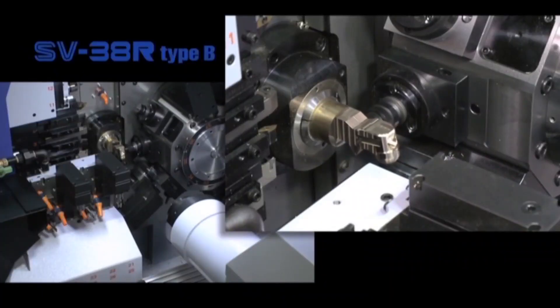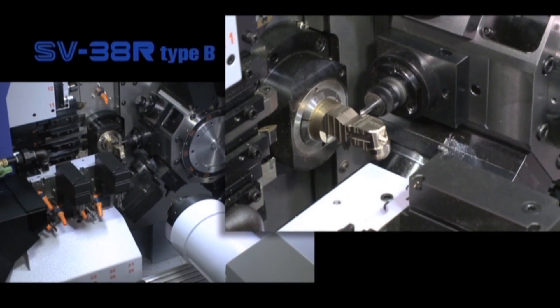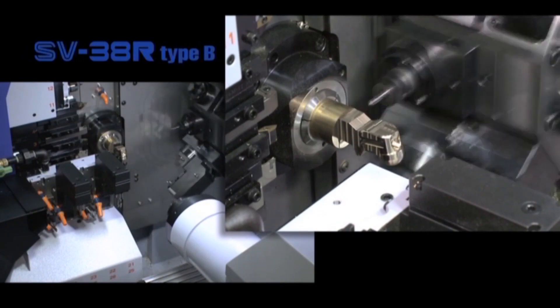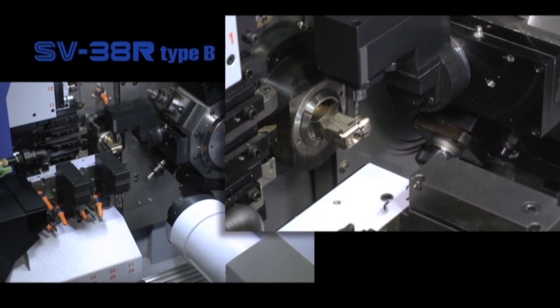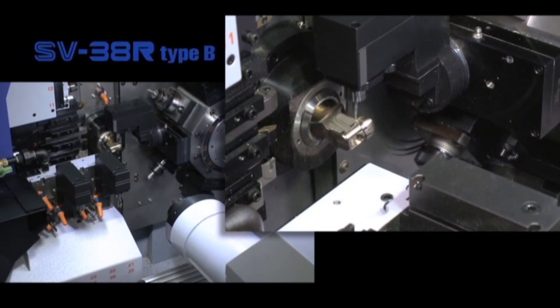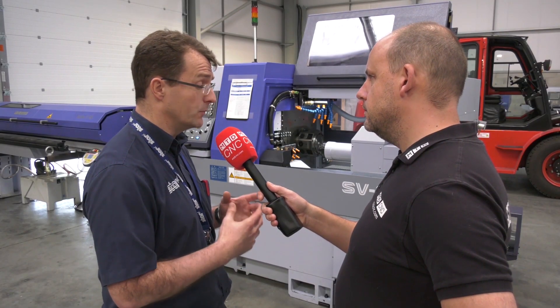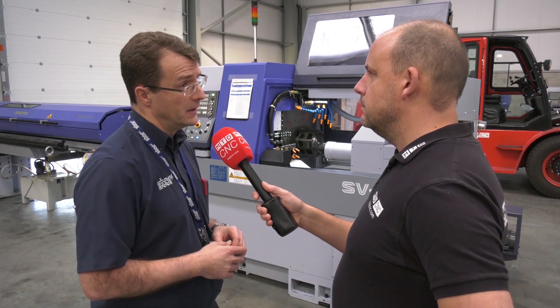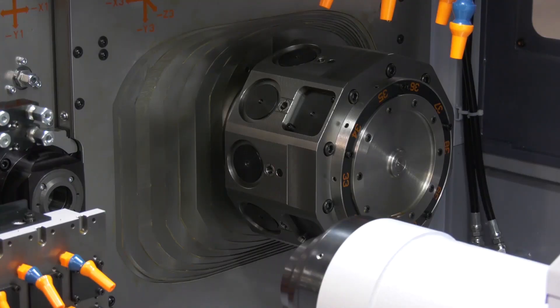What's the purpose of having a turret as opposed to another platen on the right-hand side? I would have thought you could get more tools with a platen and it would be faster with less idle time. Actually it's the opposite in terms of tools — our turrets can hold three tools per station, so we can hang an awful lot of tools on the turret. It gives us more flexibility and more power as well. This particular turret has five stations with B-axis capability.